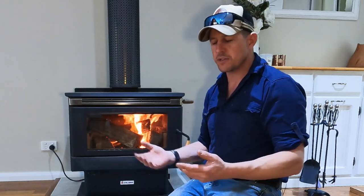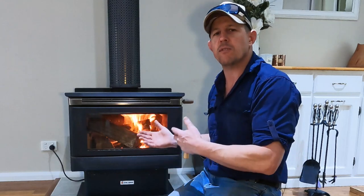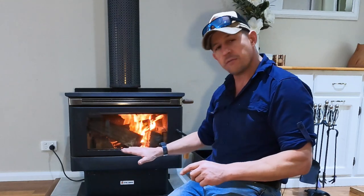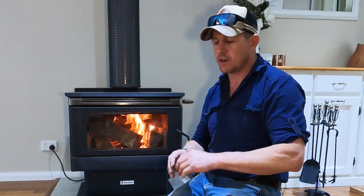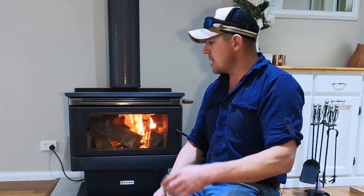So there you have it — basic tips for fireplace maintenance. I know this might sound simple to some people, but if you've never owned a fireplace or operated one, I hope this helped. A couple of key things to remember: every couple of weeks, or when ash gets above about 50 mil or to the height of the front of your fireplace, take a few scoops out and get it back down to that 25 mil base — that'll protect the bottom of your fire and give you a good platform to work off. Check your dampener, check the seal on your door, and clean your door so your fire looks nice. Stay warm.